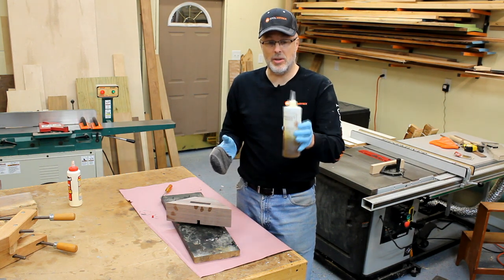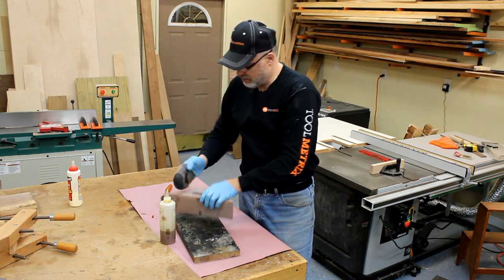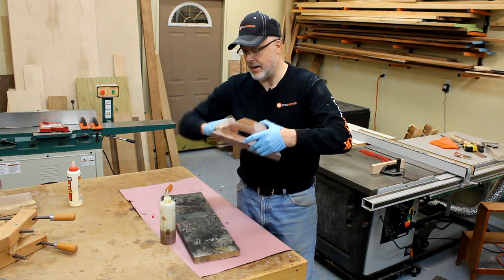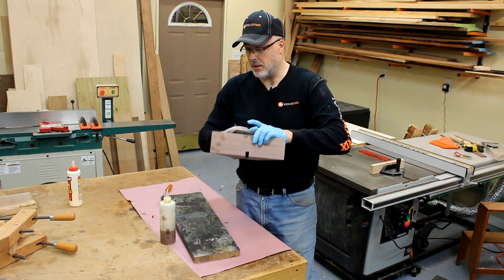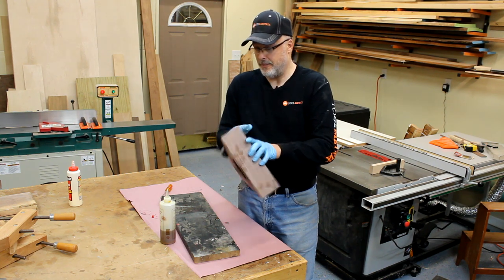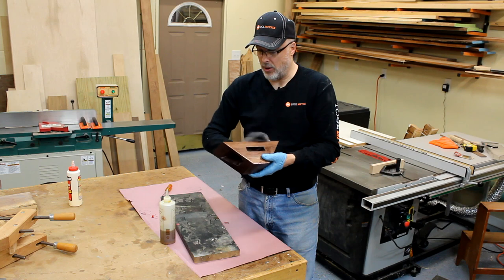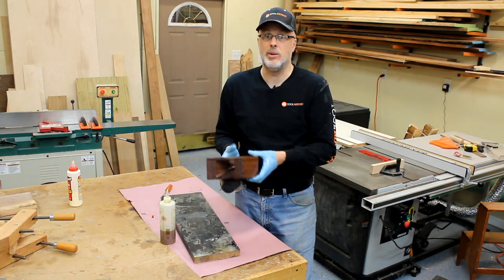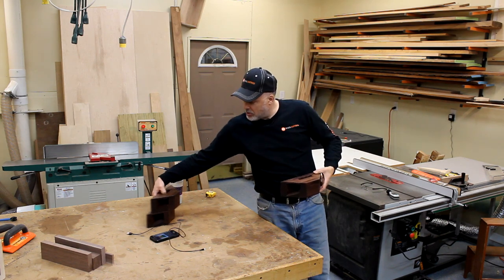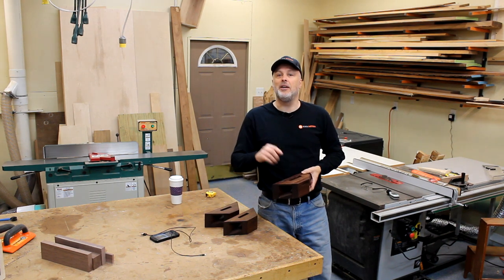Next I'm going to hit it with a couple coats of finish. I'm using Mahoney's Finishes walnut oil — I really like this product, but you can use whatever clear top coat or stain you want. If you're staining, be aware that it's tricky to get into some of the nooks and crannies, so a clear penetrating oil is a more forgiving and easier way to go. With the walnut oil I load it up heavily and let it sit overnight to see what's left to wipe off in the morning — usually nothing, it soaks it all in. Hit it with a couple of coats, and that wraps it up! A super simple project — hope you enjoy this. If you did, please click like and subscribe to the Toolmetrics channel, and I hope you crank out a whole bunch of these for your holiday gift list. Thanks for watching.